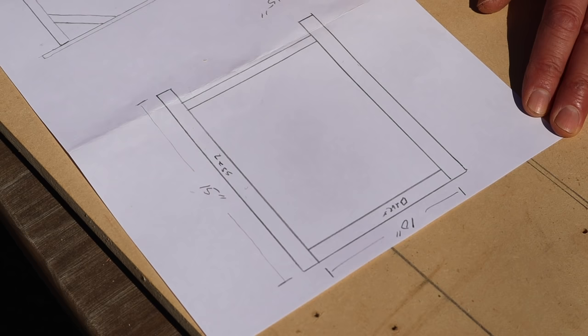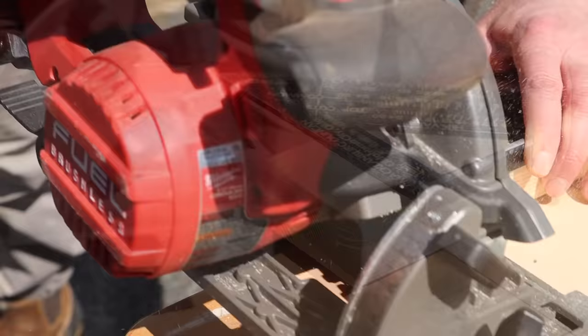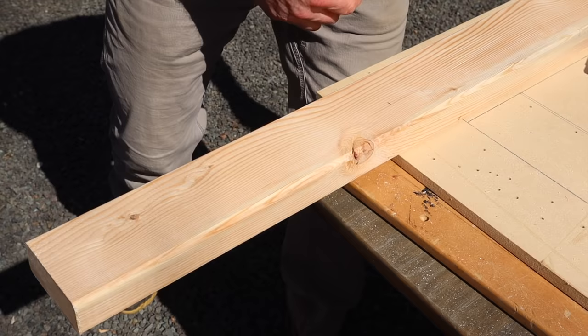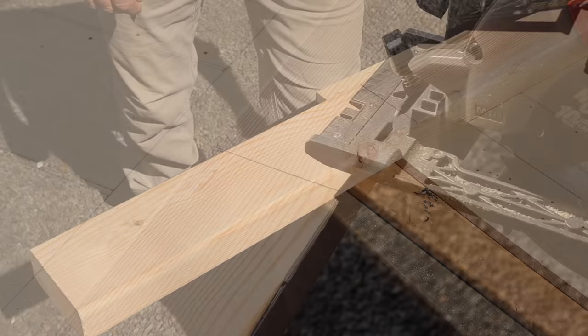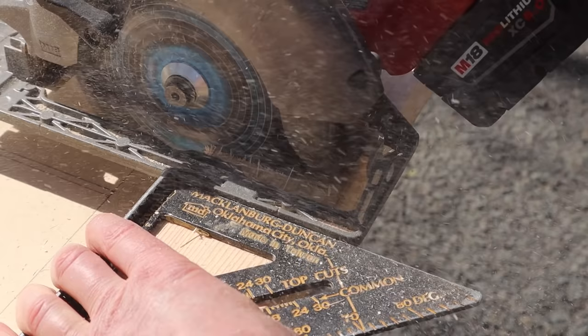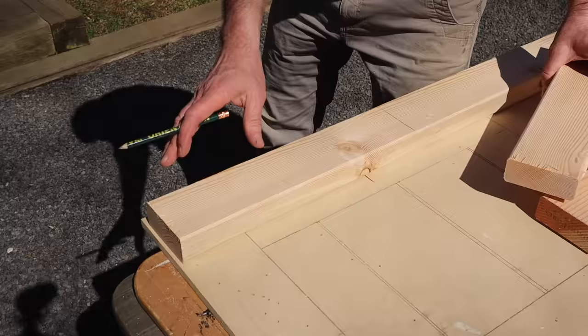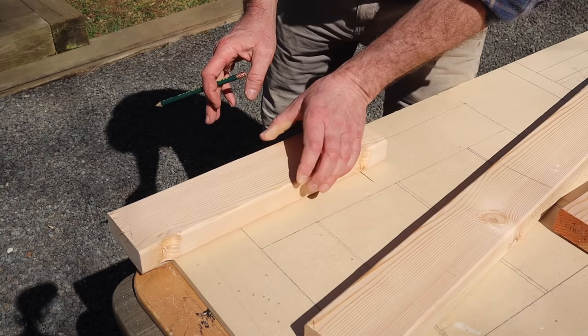We'll need two of these rectangles for each side of the bench. Let's get started by cutting four of what I'm calling the legs at 15 inches. I'll use the speed square as a straight edge and take a little off the end to clean up that side. Next I'll measure over 15 inches, make a mark, and use the speed square to square across. Now align the blade up with that mark, use the speed square, and make the cut. I'll use the first cut as my pattern — make sure I'm flush at the edge and mark for the next cut. Notice I've got a piece of sacrificial material here; that way if I cut into it with the circular saw, that's okay, and it also supports the piece and keeps it from falling on the ground.